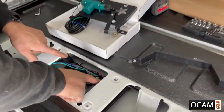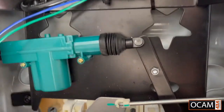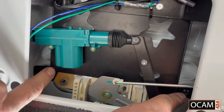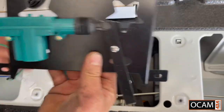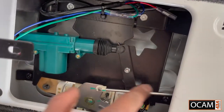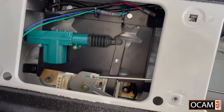I've already fit one but I'll give you a quick rundown. The first step is to take out the two Allen key bolts for the handle. Once you remove those, this plate goes in first on its own — it slides in making sure the striker sits under the link, and the whole purpose is to lock that handle.